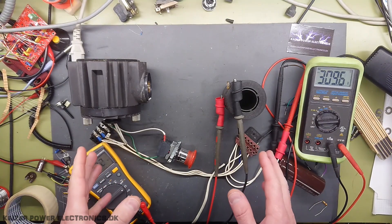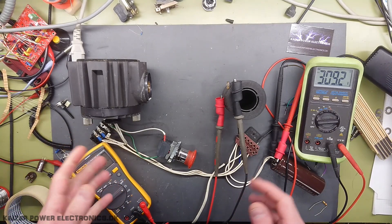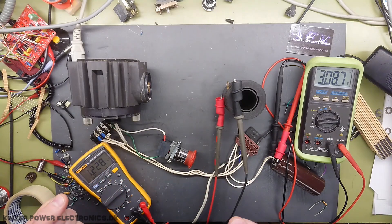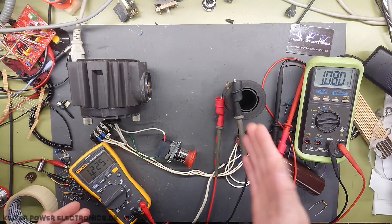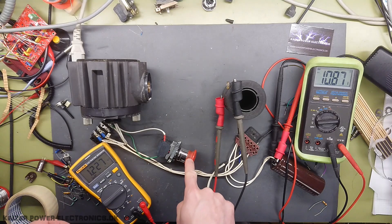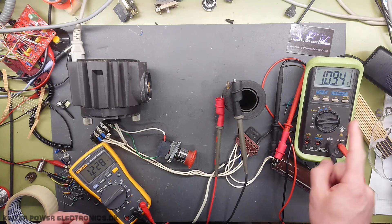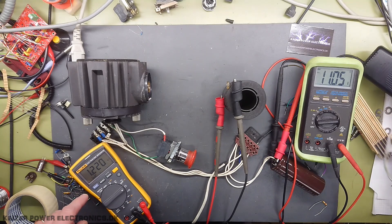Be very careful when working with UV light — you can damage your eyes. I'm wearing UV goggles, and also take care of your skin. This is only going to be a short demonstration, but you can get skin burn as well. Now for the actual test setup: we have the sensor sitting here, we have the deuterium lamp in its enclosure, and I have a switch to close the 310 volt DC charged on the capacitor. We will do that in a moment and read out the resistance of the sensor, and of course test the same glasses and such that we did outside.